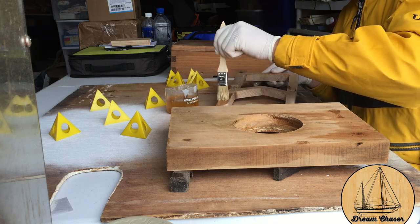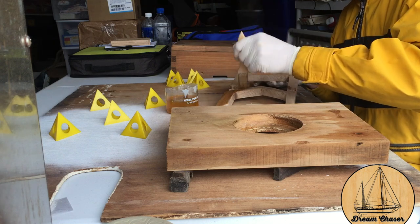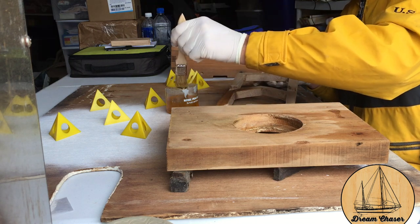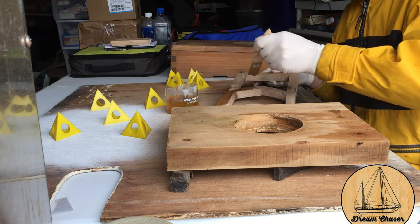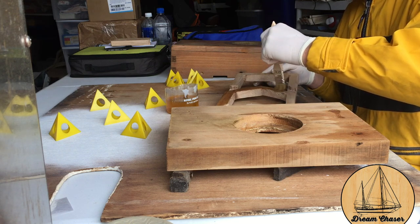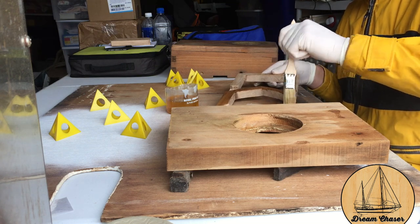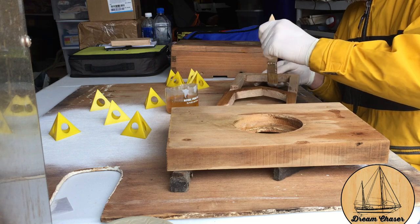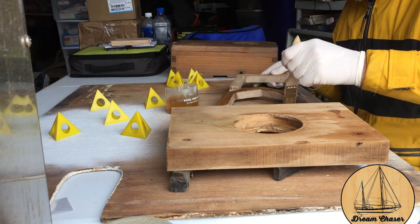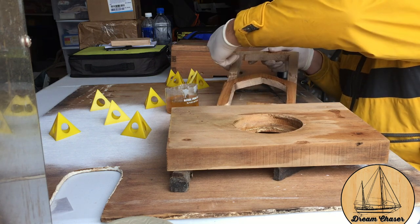What I'm doing is putting a thin layer on this. Basically I want to encapsulate this entire piece of wood in epoxy resin so it becomes waterproof. As this sits on deck, I want to make sure we're not in a situation where this piece of wood would rot over time — it should last a lot longer encapsulated in epoxy. I'm not going to put a thick coat on here, and especially not on the outsides very thick because this is a nice tight fit inside the Dorado box.